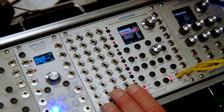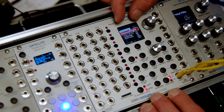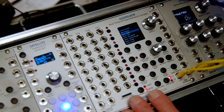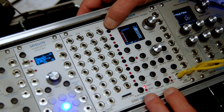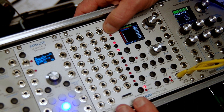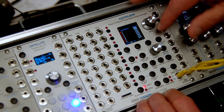That's one of several different modes you can have. In addition to link mode, if you've got a stereo sample it will automatically play as stereo if you put the second channel in stereo right mode. We also have a mode called cycle. What I'm doing now is loading a new set of samples from the SD card. This demonstrates the cycle channel mode, where when I provide a trigger to channel 1, it first triggers channel 1, then triggers channel 2, 3, 4, 5, 6, 7, 8, and cycles back around.